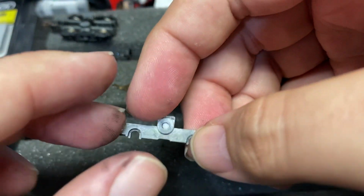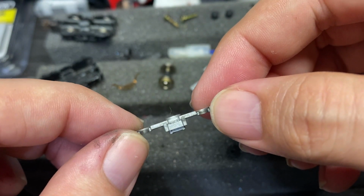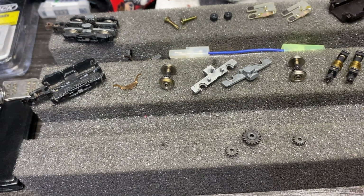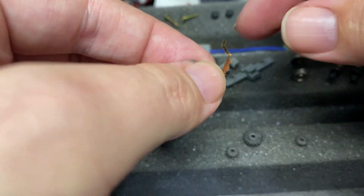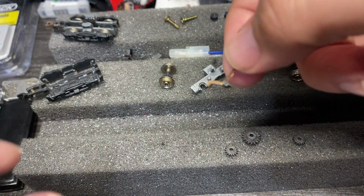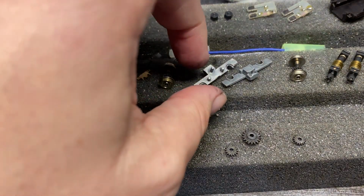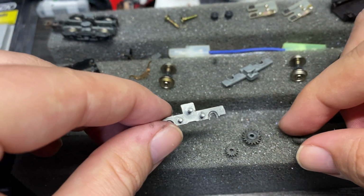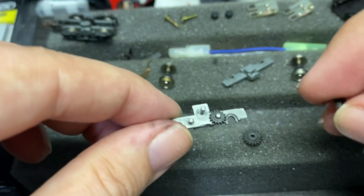The state of the metal truck frames here was not too bad. I got in there and cleaned out the, I call it the bearing surfaces, but yeah, there was quite a bit of buildup on our little copper wiper here. As you can see, the actual contact patch is very small, but got that cleaned up. Our gears weren't in too bad a shape, so didn't have to do a whole lot for those. So now the only thing left to do is to put the business back together here. Two small gears go on first.